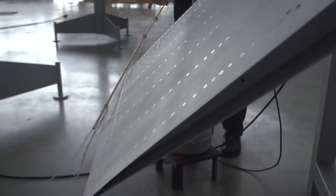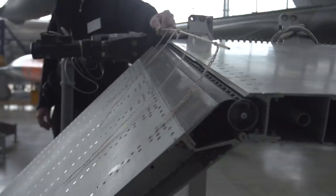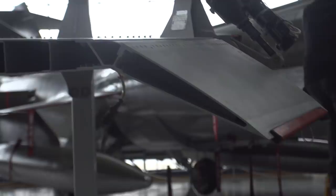Pilots have to be careful though. If they reduce throttle to idle, the air injection stops, which is not something you would want if you are at low speed like during a landing. Here we can also have another look at the leading edge flap. With both flaps deflected, it's a good demonstration of how the curvature of the wing is increased.